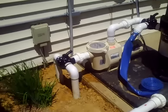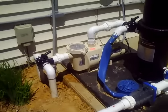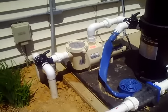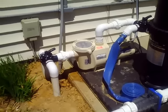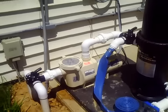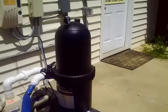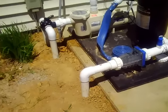Let's take a look at the pool pump. We need to understand how your pool pump works in order to understand exactly how you're getting air bubbles back in the pool. The two pipes coming out of the ground and going into the front of the pool pump is called the suction side of the plumbing. All the water coming from the pool is pulled in through those two pipes and into the front of the pump. Coming out of the top of the pump is the discharge side, or pressure side. Water is pulled in through the front and discharged out the top, then filtered through our cartridge filter, chlorinated through our salt water chlorinator, then returns back to the pool.